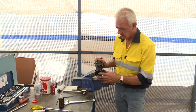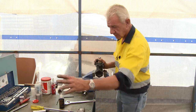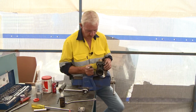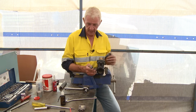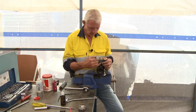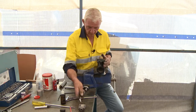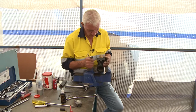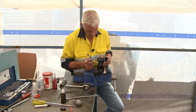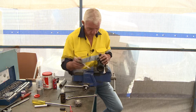This valve here is an auto air valve. It works in conjunction with a pilot valve and a Thompson valve. How do I know there's something wrong with an auto air valve? There are two things that will happen. One is I'll find that air doesn't pass from the bottom of this down to the Thompson valve, identified by this little fitting here which has the airline come down through it, tees off and goes down to the Thompson valve. When the pilot air comes down here, if the diaphragm in here is punctured or ruptured, the piston in there won't lift off the seat and allow the air passage down through the pusher line to the bottom of the Thompson valve.